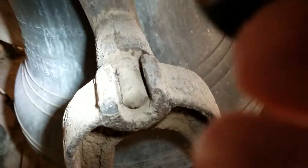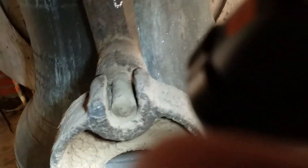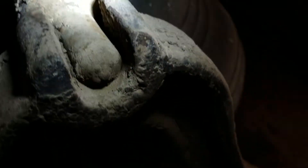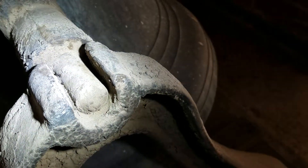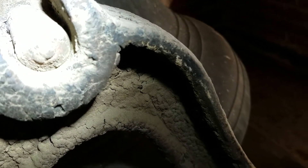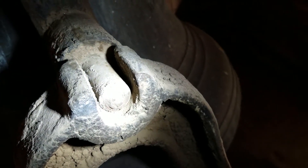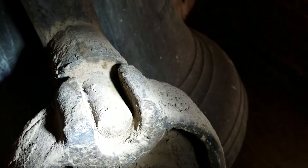The next thing that we want to look at are the bearing points. This is where the bell actually pivots as it swings — that pin is what pivots. This should be cleaned out and greased at least once or twice a year. Here you can see that this bearing shaft is very, very dry, with a lot of grit and dirt in there. You've got metal on metal, which makes the bell harder to swing and causes more vibration than necessary. So that needs to be cleaned out and then packed with grease.